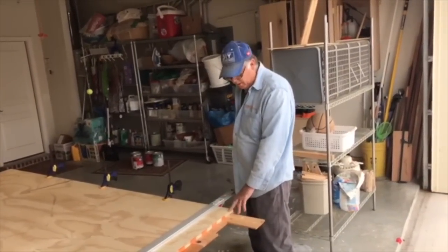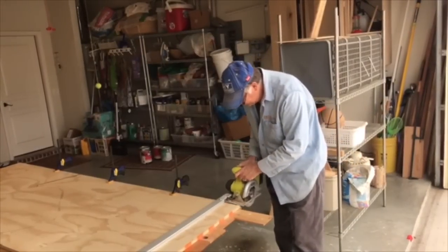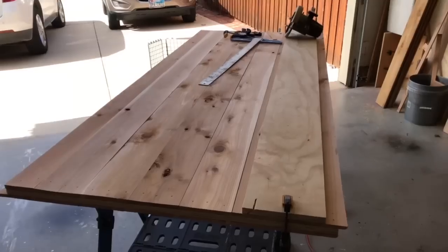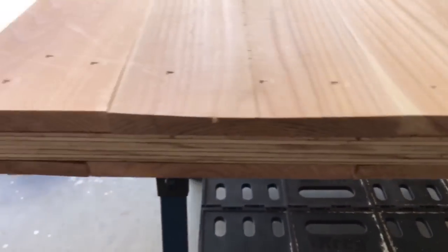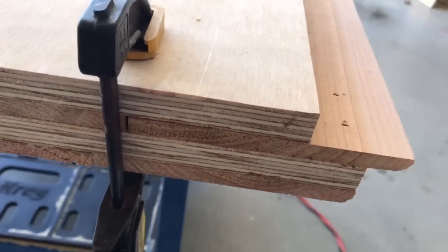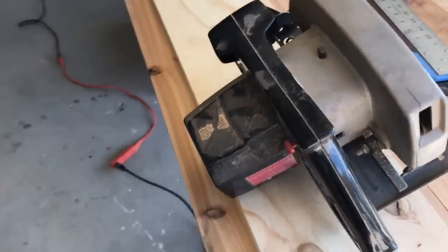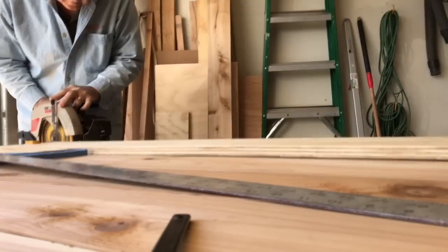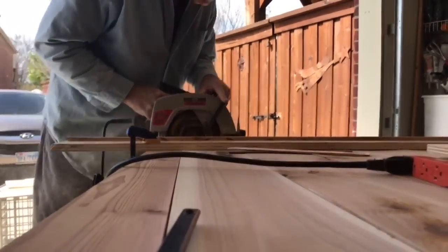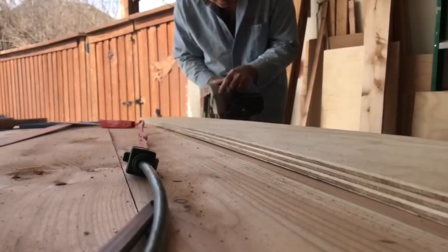I flipped over the door and now I'm just going to trim off the edges of the excess — I have my straight edge clamped at four inches for spacing on my saw. It's that easy. I have cedar on both sides, the end cut is trim flush. Now we've got to cut this edge and this edge. It's oversized, so I'm going to make this cut first, then cut the other one to 34 inches. We've got a regular circular saw out — needed something with a little more depth. First I cut one edge, get it smooth, all the way through. After that we cut the other end — it's a pretty easy cut once you clamp it all off. I flip over the table and proceed to cut the last remaining sides so all sides and ends are square.